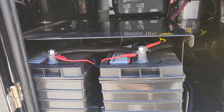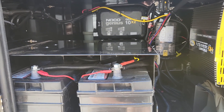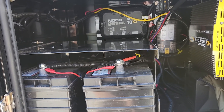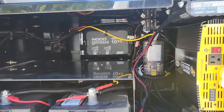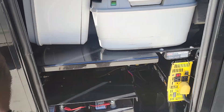That's the charging profile for type A because these are lead-acid batteries. I do plan to go to lithium eventually — I've had these 10 months, no problems, they work great. I've gone three or four days without ever having to worry about discharging the batteries because of my setup. I'm sure I could go weeks, but for peace of mind down the road I'm going to go with lithium.